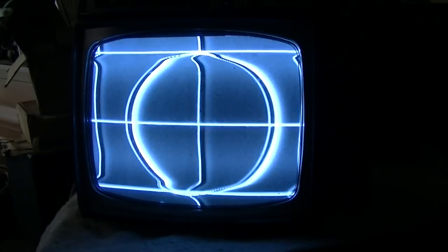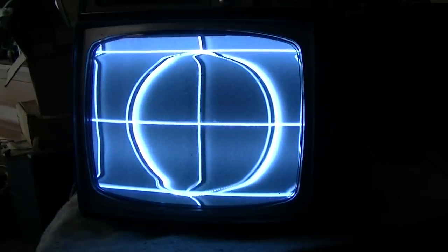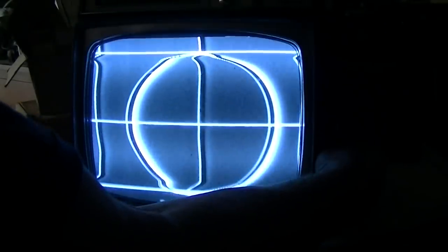So I've recapped it, and that's the garbage I get. Really? This thing's been fully recapped. We got full vertical deflection now, and the picture actually looks good, but rotating the fine tuning is not doing anything.